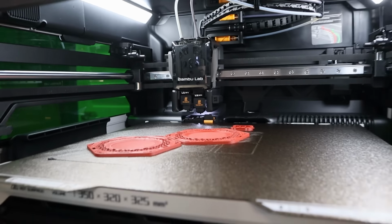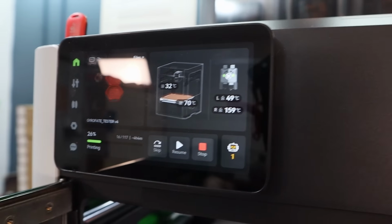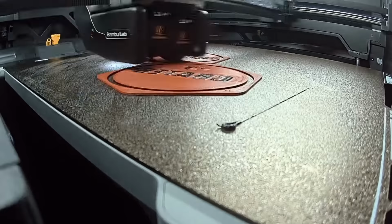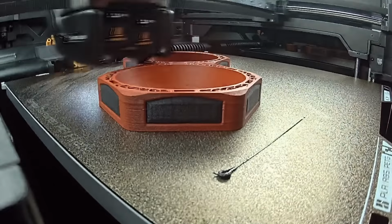So with that red brick carbon fiber filament, there is always a bit of buildup on the nozzle, and thanks to the nozzle cam, it identifies that problem, and that's great when you're awake. But I ran quite a few prints at night, and the notifications didn't wake me up. So the print was paused for several hours. Now when that happened, the print must have cooled enough to cause something to shift, and that led to that visible layer alignment issue.